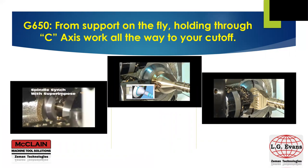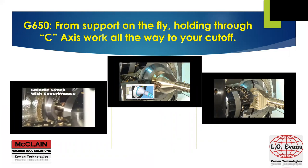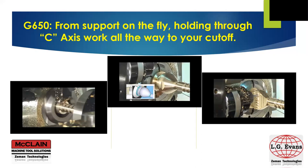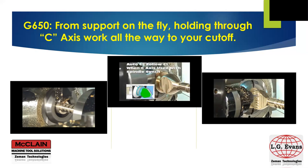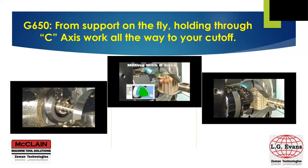If this were on an M machine, we would have the added bonus and power to program a G620 after the G650 and bring a turret tool into the cut at the same time — still only working with that same one X, one Z, and one part. As the part gets machined further in Z, the amount of whipping that would have occurred is completely eliminated from the operation. We can utilize the full stroke of the Z1 axis while we support the part in the cut. In our second video, the sub-spindle collet never opens as the gang transitions to a milling operation. Once the spindles are synchronized, they stay that way from turning through C-axis work and back to turning. In the center video, we see a small inset with the milling animation. All of the code for this part was generated using Esprit CAD CAM software, and the insert shows a simulation of the machining — the similarity to actual cutting is uncanny.